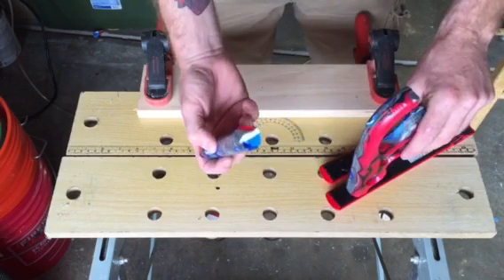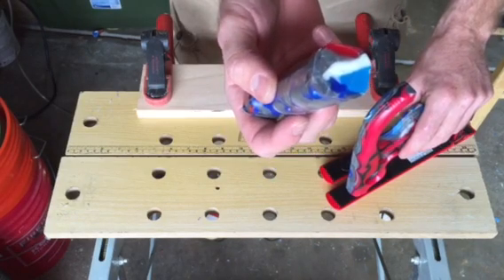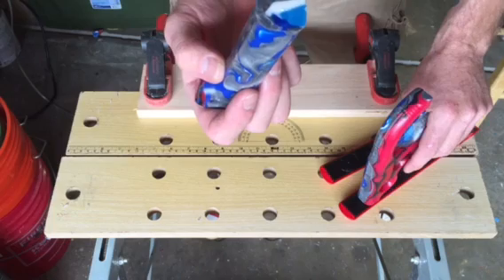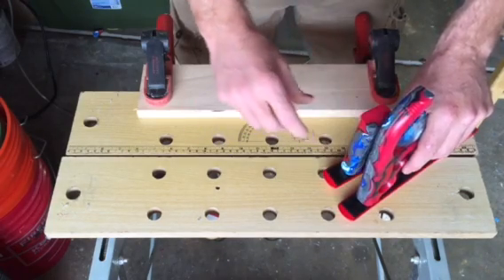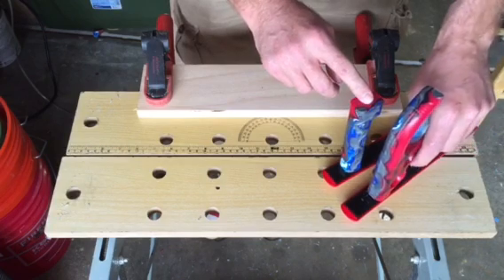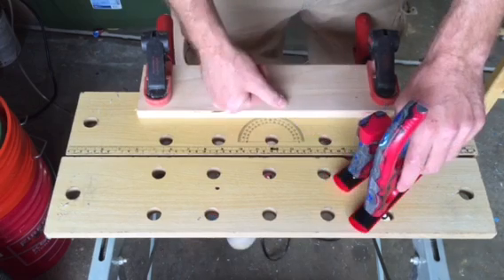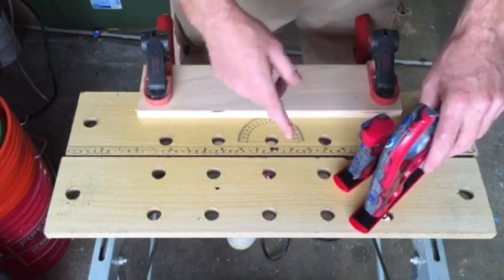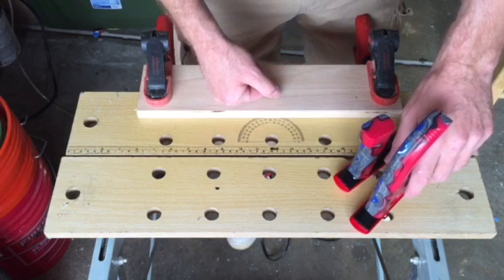You can see that it's molten in the center there but not quite on the edges. That means it either wasn't cut flat or I rocked it a little bit, so you've got to make sure it's heated up all the way across. This one's getting pretty close to good to go. A little pressure. And when you're done you just let these cool off and the material picks right off — whatever's left over comes right off.